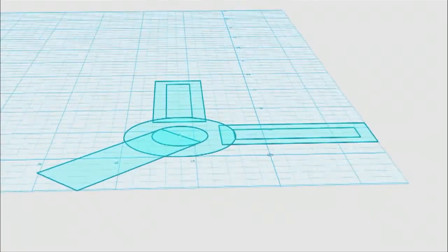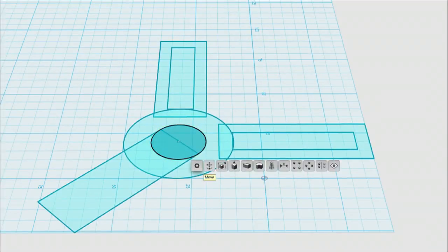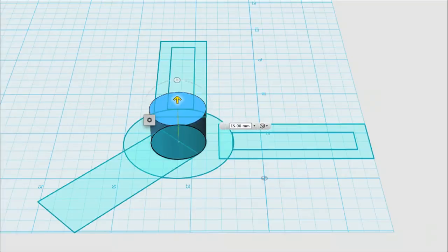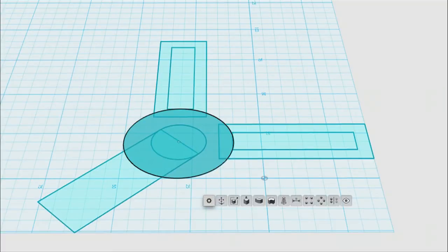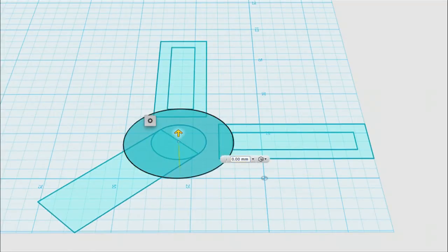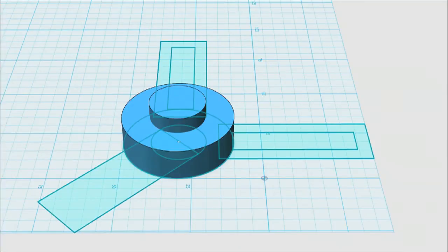You can see here it's just flat. Then you take all the parts of your drawing one by one and create 3D shapes with them. The first one will be the hole where the bottle brush goes through, and we'll make that taller than the whole part is going to be. Then I'll extrude the outside of the collar that holds the bottle brush and make that the height that I want the whole part to be. Now I'll unhide the first part and punch that out of the bigger part, so it creates a hole.